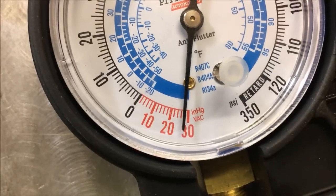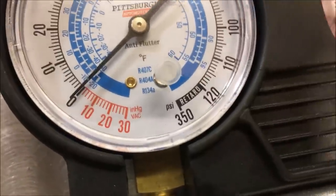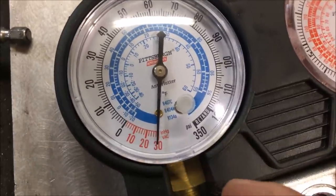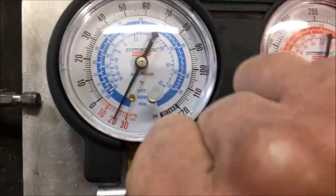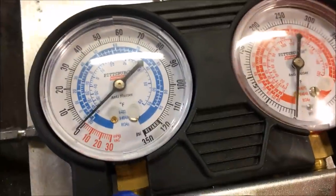It's unfortunate — once those plastic vanes wear out just a little bit this thing is probably done, whereas metal vanes would have lasted longer. Let's turn it on and see if we get a good vacuum. No — I'm not getting the same high vacuum I used to get, so I probably have to take it back apart. Might just need some oil pumped through it yet. I need to open this thing up for a minute and just let it pump some oil into itself.